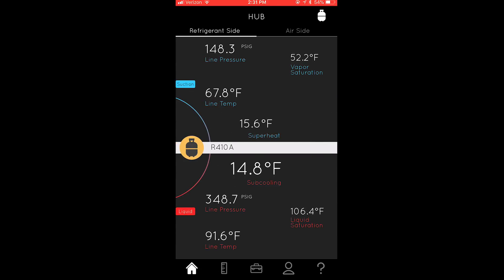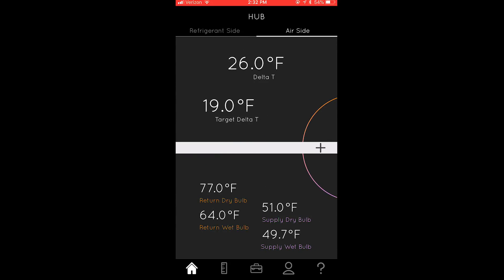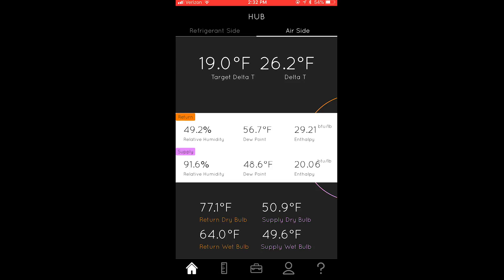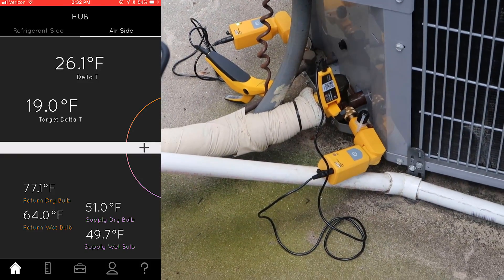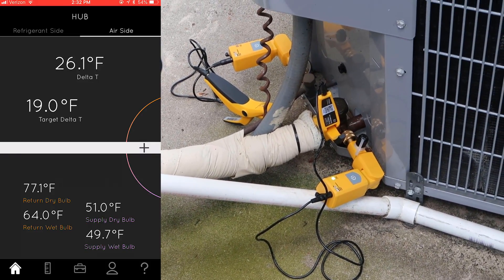Air subcool is 14. Let's see what we're rated at — rated subcooling is 13 degrees on this unit, and we are at 14.6, so charge is set in well. This is the Hub 4 here, the Hub 2 is inside, and when you put them all together in one case, that is the UEI Hub 6 kit. Good stuff, nice range. I'm Brian with the HVAC School Podcast and HVACRschool.com — thanks for watching.